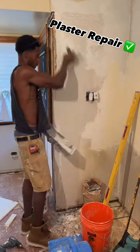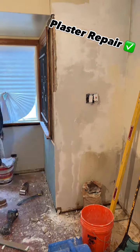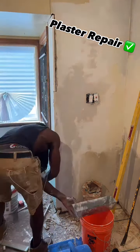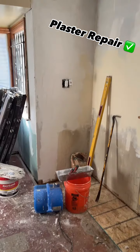Base coat Durabond. The gap is so big you can't fill it in on the first pass — you gotta leave a little indentation so you can build out. After the Durabond sets, I did the other side so I can get my corner bead on. After all this mud dries, I build out the corner. Looking good in the neighborhood!